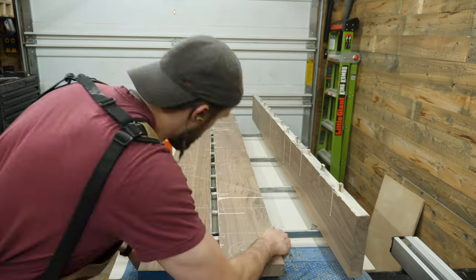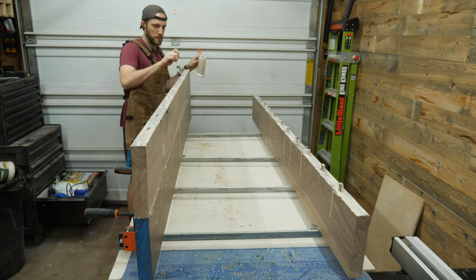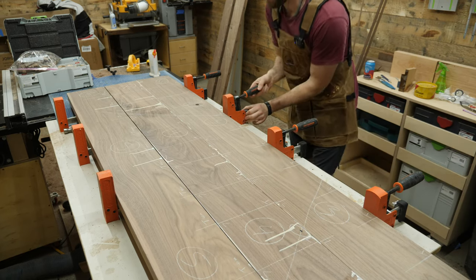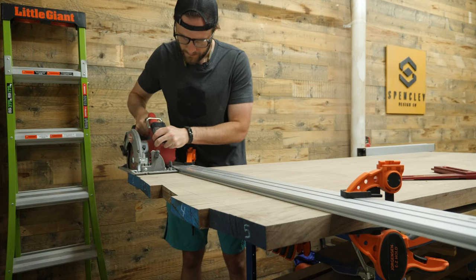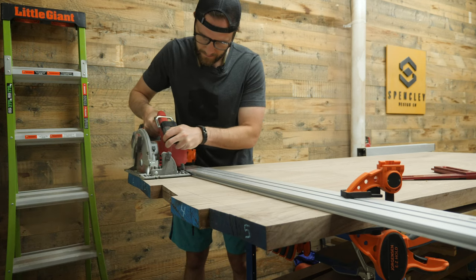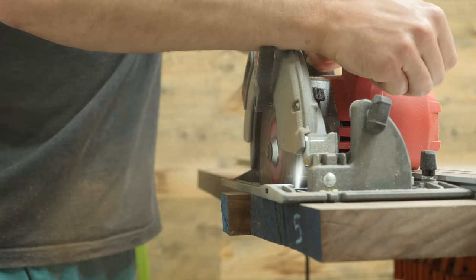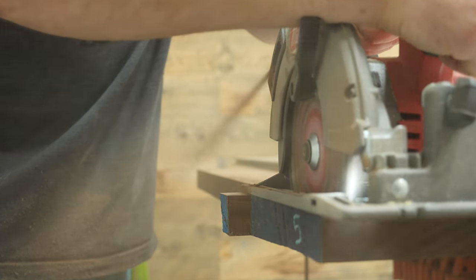It takes more time than you think to get these large pieces settled in place, and I don't want to risk the glue setting up before I get everything clamped together. A scrap of plywood, box level, or some random piece of aluminum that I had laying around is the perfect thing to run your circular saw against to get a perfectly straight line to cut.